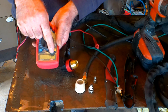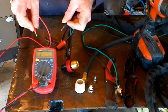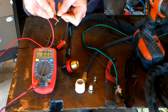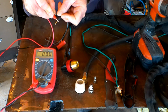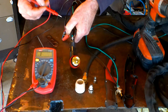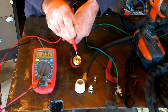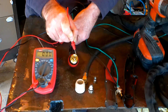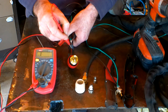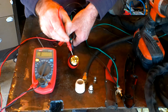Just your standard electrode. So grab your multimeter - at the moment it reads 'one', meaning no continuity. I need it to read zero-zero-zero, a direct short. If I touch these two probes together we get a direct short - zero-zero-zero. Now if we stick one of these prongs under this joint here where the wire goes into the torch, and touch it on the other side - we've got a direct short.